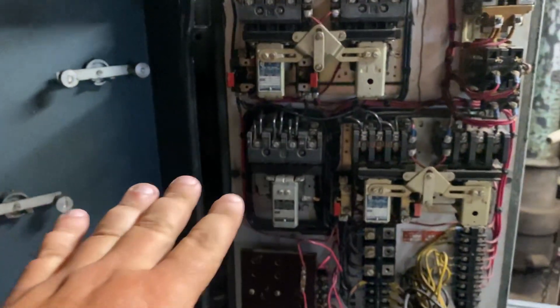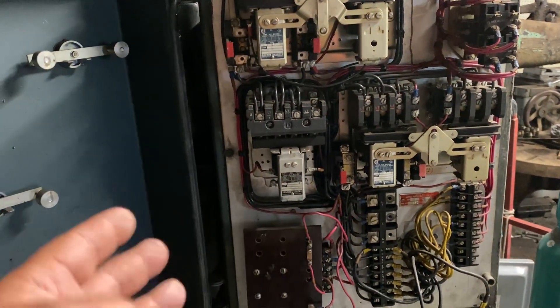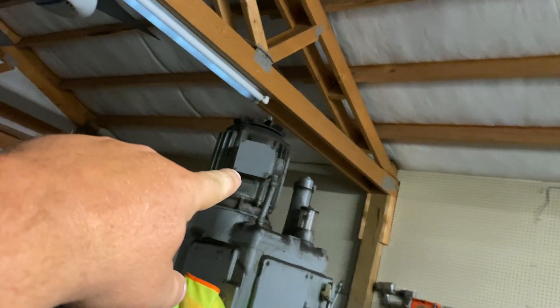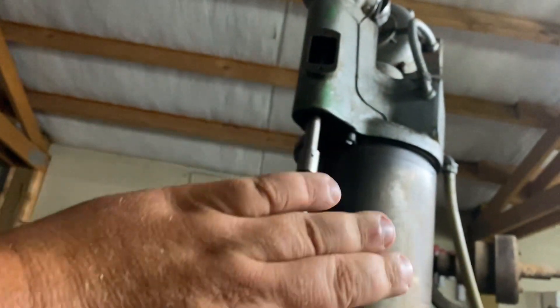On a complicated machine like this — it isn't super complicated, but older machines have lots of relays and transformers and stuff in them — there are a few things you have to bear in mind when you're going to switch voltages. First thing, of course, is rewiring your motors to match the voltage you're going to be supplying. That's easy, easy peasy.